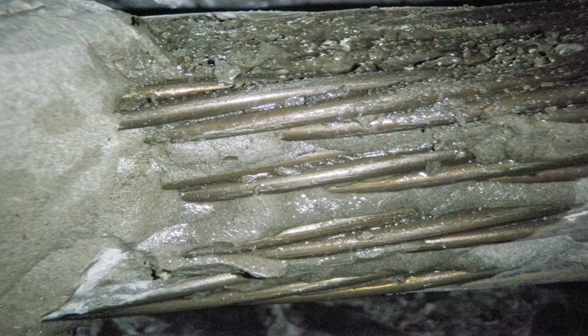He's just got a hammer and a small chisel, and he's physically removing the grout from the exterior of the tendon assembly and chipping down just till you get to the strands. And you can see that the impregnation material is clearly present in that location. And they did that at 24 locations like this, and then they patched those areas back up. Here you see they removed the grout all the way around the periphery. They did not remove any of the grout from between the strands because these are live strands, you know, they're under load, but they wanted to see that the material had got there uniformly.